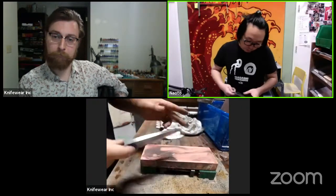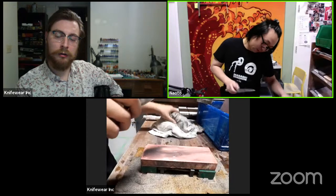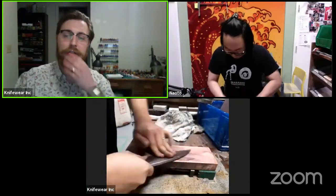Someone the other day mentioned that they want to send me a knife that has a little flat spot from sharpening. That's part of how much pressure you're applying. Also, the angle that you want to follow through. So there are two factors in there. It doesn't get as nice a kasumi as I want, so I may just cheat sometimes. In general, though, you shouldn't be pressing too hard. And when you do press, you should be maintaining a consistent pressure.